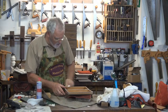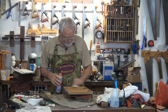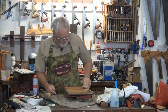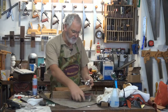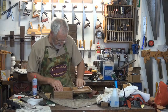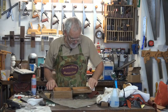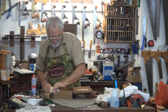What kind of wood did you use for those boxes? These are actually veneered boxes, so it's on a European birch ply substrate. The main timber is black bean, and the solid edging around the tops and the stand is Queensland walnut, which isn't a true walnut, but it sort of looks a bit like black walnut, and it's got more of a greeny tinge to it. But it doesn't smell anything like black walnut. It stinks. Colloquially, it is known as dog dew. If you smell it when it's wet, it just smells like fresh dog stuff. It stinks. But it is a beautiful timber to use.